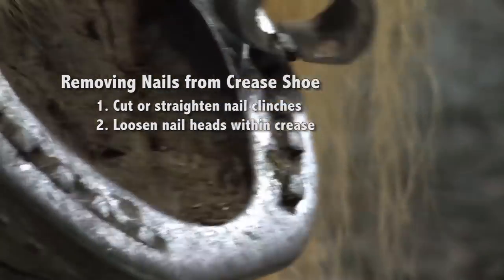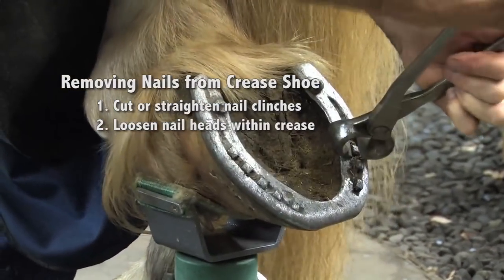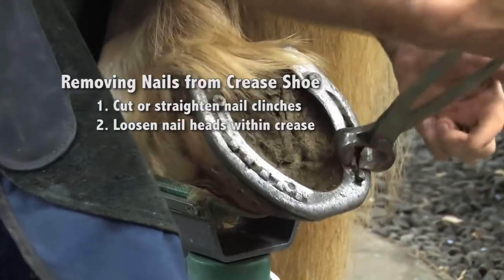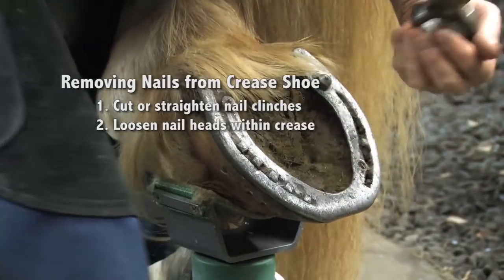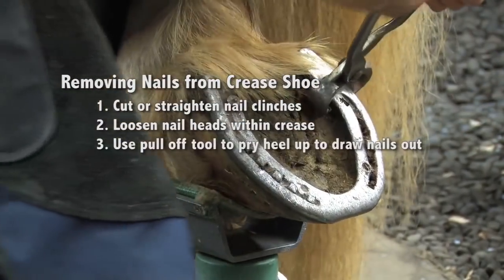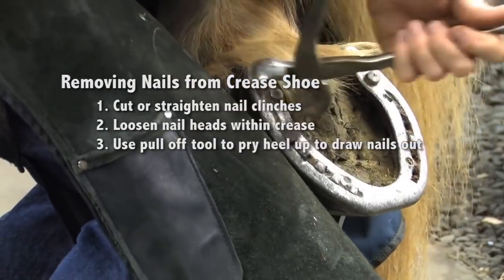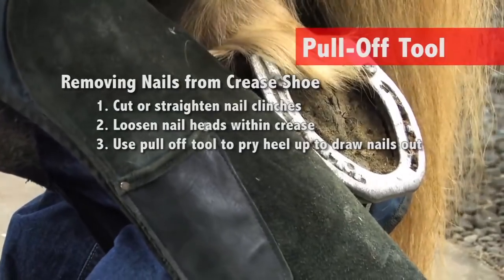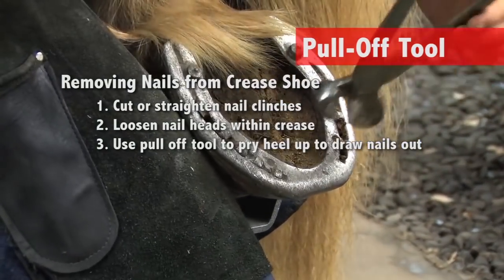You can see that Pat is wearing hard on the outside, not so much on the inside — see how the nails are still sticking up. And that's because he's base narrow. We've bred these horses for centuries to be base narrow so they travel close and can stay within the furrow. I'm just going to pull the nails that I can out of there, get between the heel of the hoof and heel of the shoe, give one pry back, set that down, and get the nails out that I can get out.